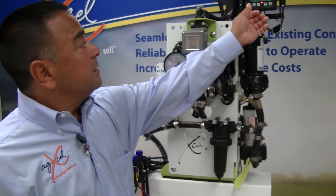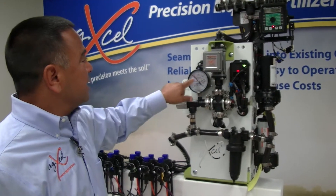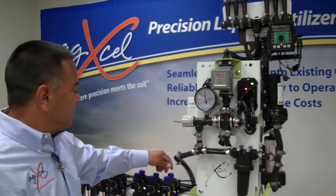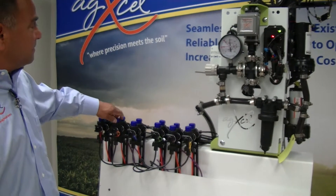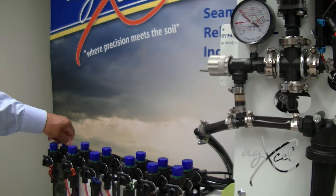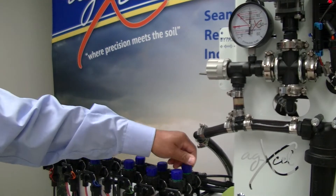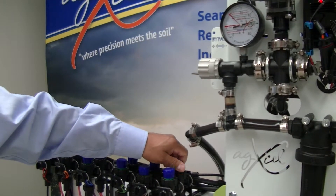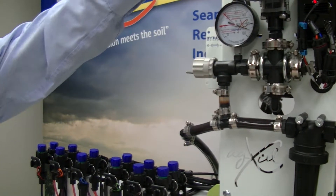If I turn on my system here, I'm going to slow down my rate to four gallons an acre — you'll notice I'm running at about 20 psi. I'm going to bump it up to five gallons an acre, and you'll notice my pressure starts to go up. That's with my orange orifice running — I'm at about 28 psi at five gallons an acre. So I'm going to open up my black orifice. I'm using the same size microtubing that the orifice would run — watch what happens to my pressure. My pressure is starting to go up dramatically, causing a lot of back pressure and not allowing me to lock in on my rate.